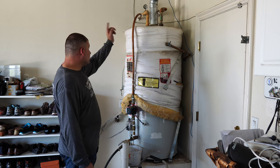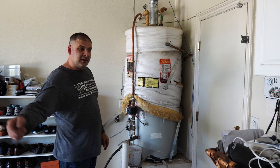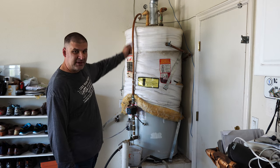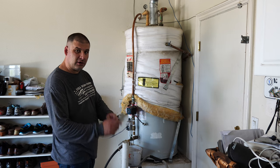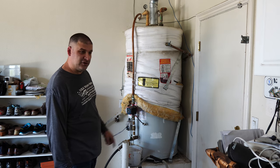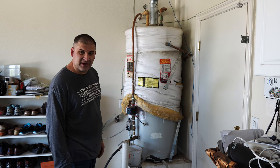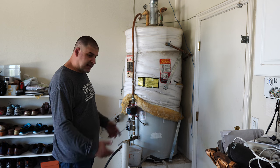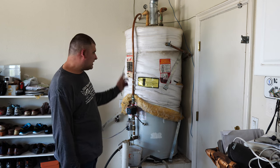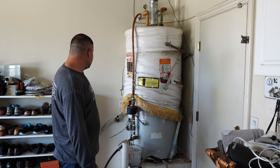Of course, also shut off the main water valve to the house. Make sure you don't get any water coming back to the hot water side, because shower valves mix hot and cold, and you might be getting water coming back to the hot water side. Usually there's no shower valve there. Also sometimes people open their faucets upstairs, and again, hot and cold mix in the faucet and it leaks back to the hot water line here on top of the water heater, or right where you're working.